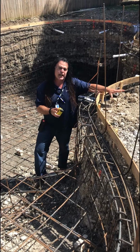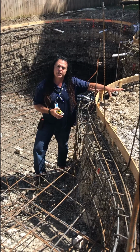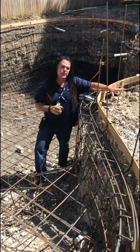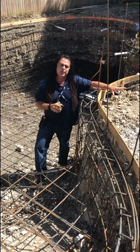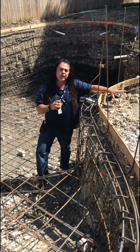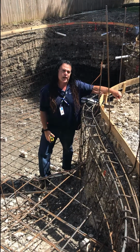So I just want to call that out to you when people are giving you the smoke and mirrors, I call it, of overdig compaction, that there really isn't a necessary need for it unless there is called out by a structural engineer. Again, most likely smoke and mirror, a way to get you separated from your money a lot faster when it's not needed.